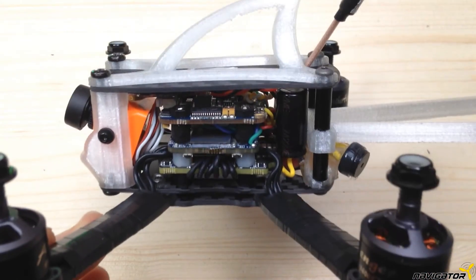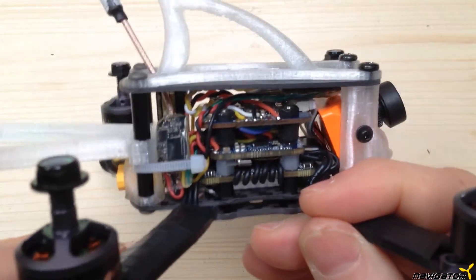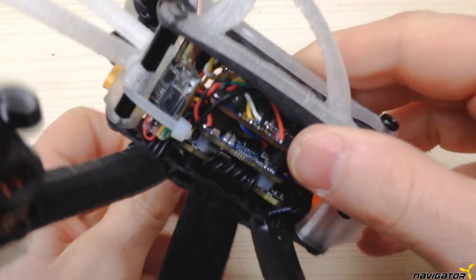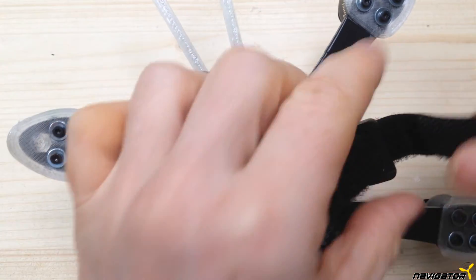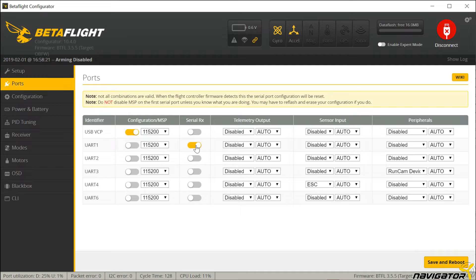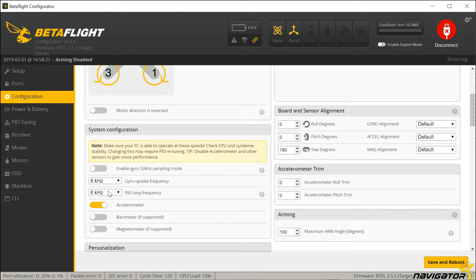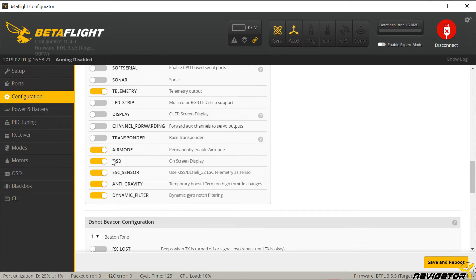As you can see, there is no space wasted — everything is stacked neatly. In this video, we have put together a 3-inch copter and made it ready to fly. If you are interested in how to configure the firmware of this copter, stay tuned. One of the next videos will be a tutorial on Betaflight 4, and this copter will be the test object. Here is a short preview: in the Ports tab, we have configured UART1 as serial RX for the Crossfire receiver, UART3 for the RunCam control, and UART4 for the ESC telemetry. Because we have SmartAudio wired directly via the receiver and VTX, we do not require an extra UART for SmartAudio in this build. You can use this concept if you are short on UARTs.